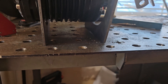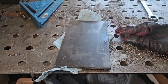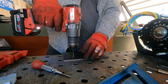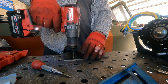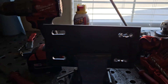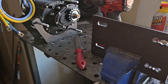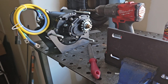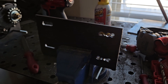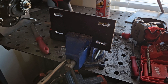We're going to make a cross piece here that will bolt down to the cart. I got that cut out — I'm going to do some slots, probably four slots, so I can tension the chain appropriately. Working on this motor mount, I'm going to weld on the bottom here. I just need to make some slotted holes so I can tension the chain by pushing the whole motor forward. Without a plasma cutter or table that makes it more difficult, so this will be easier for now. I was drilling holes and essentially filing it down — it'll work, not pretty, definitely janky.